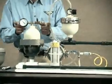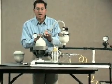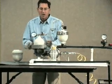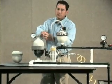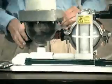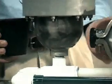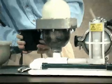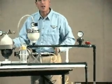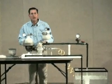Now, with the unique J model, I'm going to take the air pressure out of it and pull a slight vacuum on the bladder. By pulling a slight vacuum, we created a small reservoir for the water hammer shock wave to go up into, absorb it, and a nice accumulator for the pump to draw from. Now you can see the water hammer spike has been eliminated, and the system is running efficiently, and the pump is at its maximum performance.